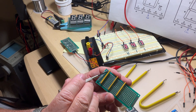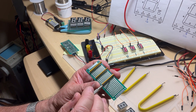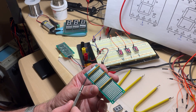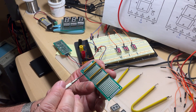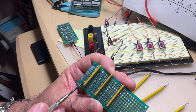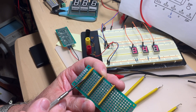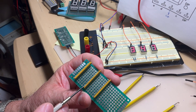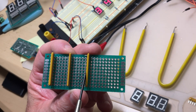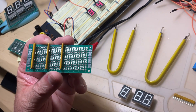My network resistor is so long that the last pin I had to fold and keep here at the top because it's unused — I don't have enough holes. I only have 10 holes and my resistor has 11. If you order the good ones I'll have mine in a couple days. Now, how do you mount them: you leave one row of holes alone, then place one single in-line package resistor, then leave five holes free, place another one, leave five holes free, and place another one.